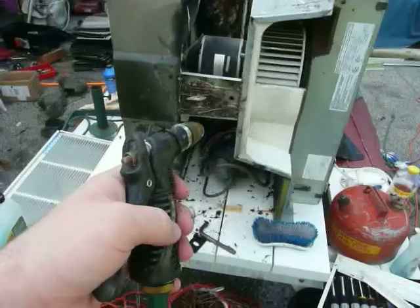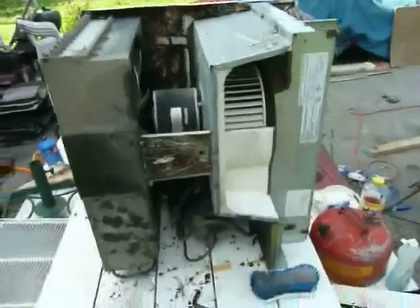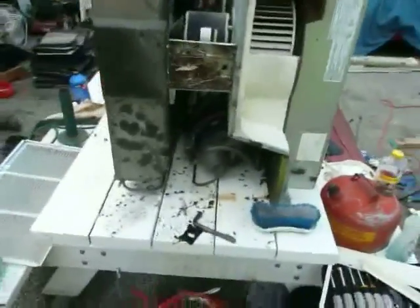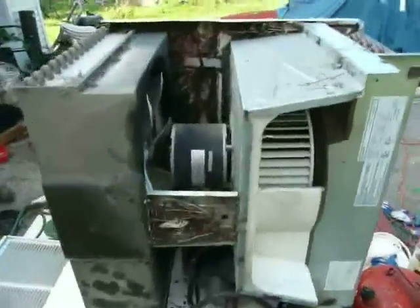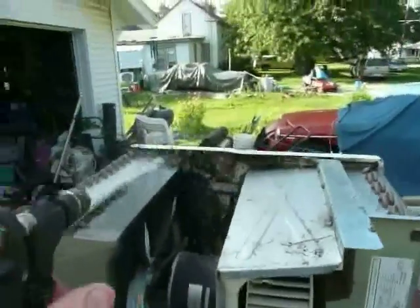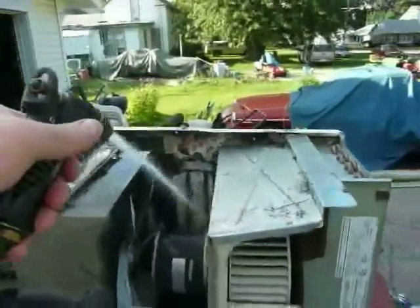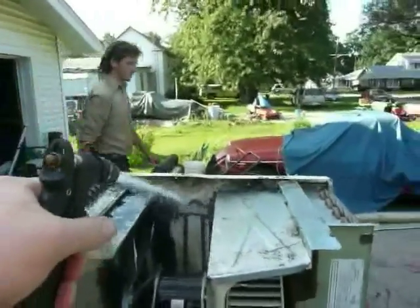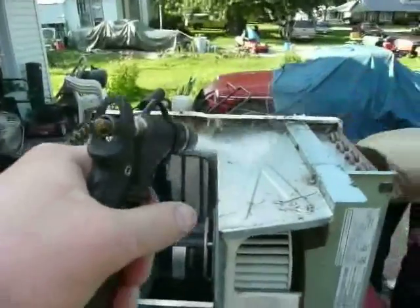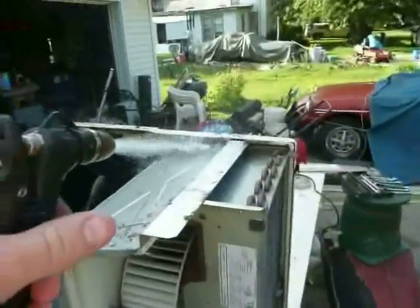You'll need your garden hose for this next part, and I would also suggest not wearing any clothes that you even remotely care about. Being careful of all the refrigerant lines, because if you break one of them, you'll be in the market for a new air conditioner. Turn the unit on its side, start hosing it out, and get rid of all the built-up garbage in here — all this stuff that Mother Nature puts in your air conditioner. See how much cleaner that's looking already? Don't squirt your resident key keeper if he's around.